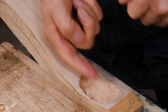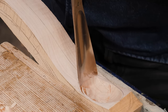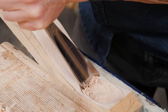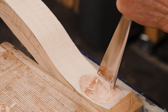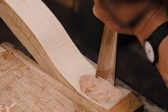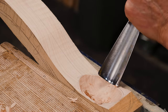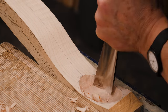I've got to be careful because I'm going into the end grain at the moment, which will only go so far. It's quite challenging to carve a ladle or a spoon this way, but it's a great way of learning about grain direction. Here I'm going across the grain because it works very effectively with a sharp gouge. I'm feeling now for the direction I want to go — or have to go — going across the grain, working it like this.